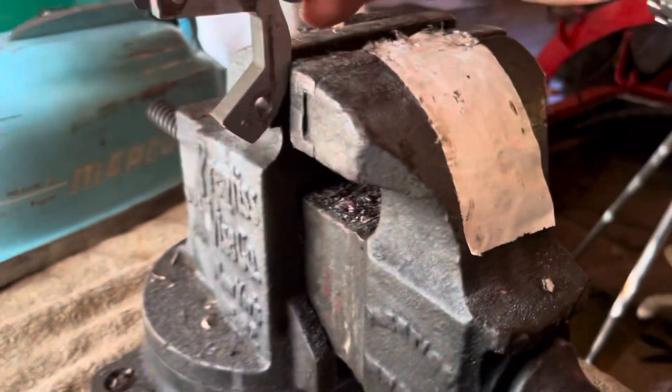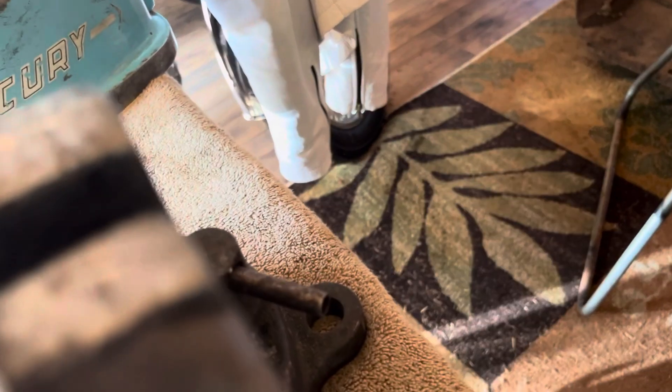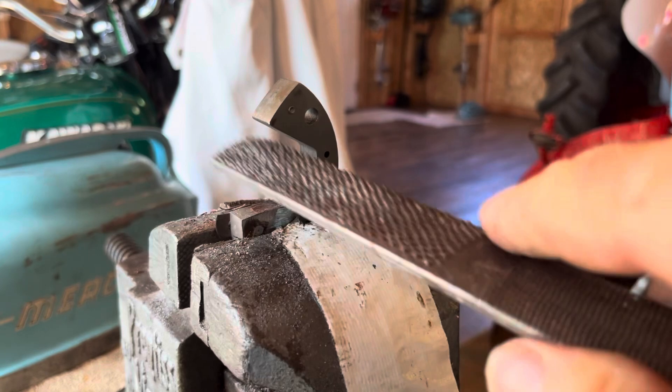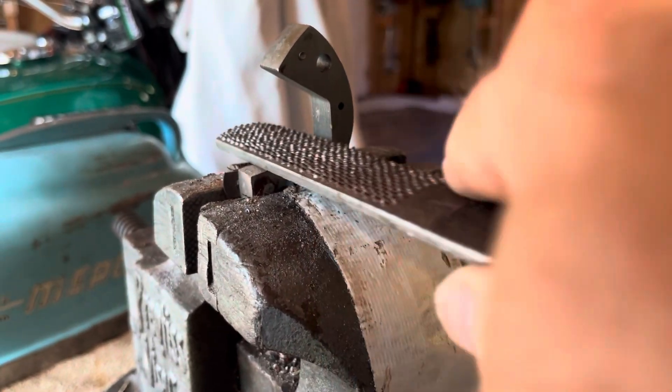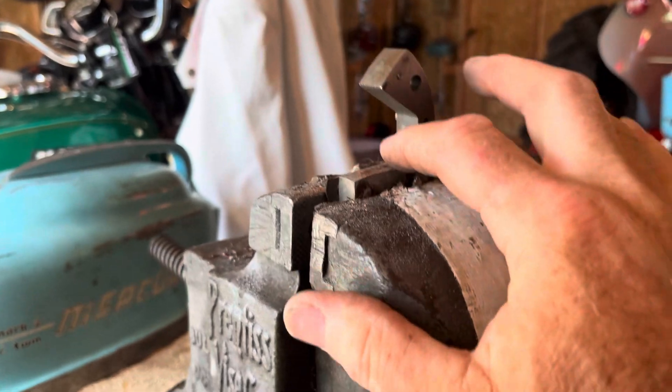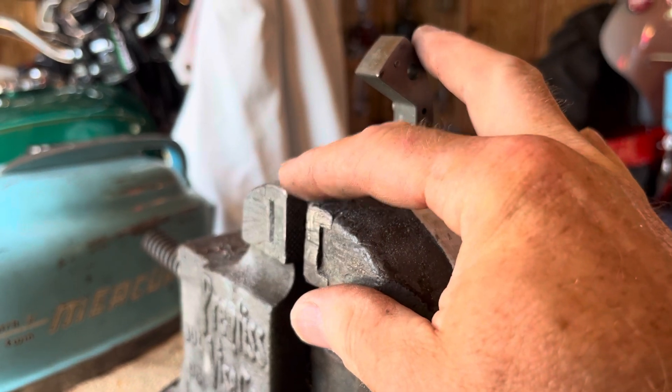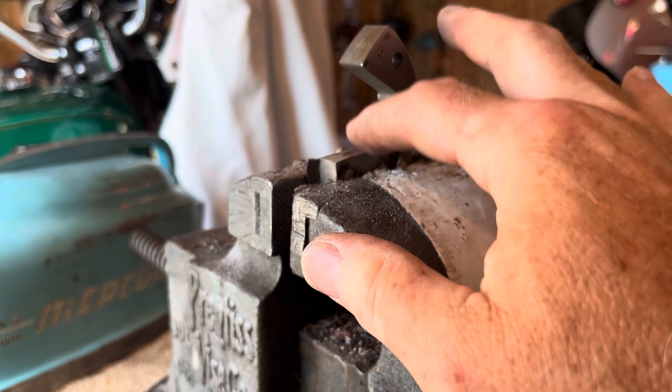Right now this opening is way too small. What I do is put it in my vise and just file it down. In all honesty it takes an hour or two and you've got to rest in between, but you just keep filing it down until you can get this side to mic out around 4.2, and the top side 4.2 — I think the sides are 4.3.